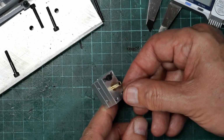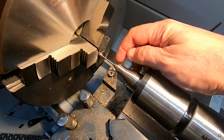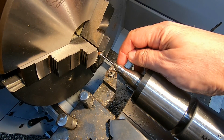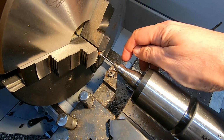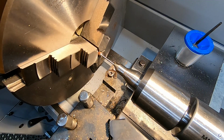So I guess it's time to have a think about making some valves. Trying to make a valve here. It looks like I'm trying to make a needle, but this will, I think, might be my final cut. I need 2.36, but I'm aiming to get 2.4 with the lathe, and get the rest with emery and wishful thinking. Well, we'll see. This is not really what a lathe this size is meant for, I don't think.